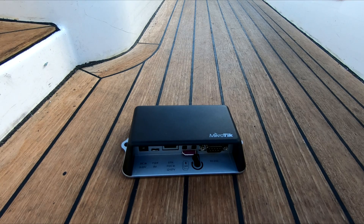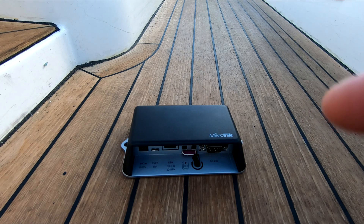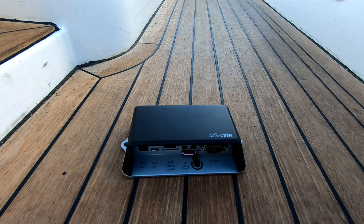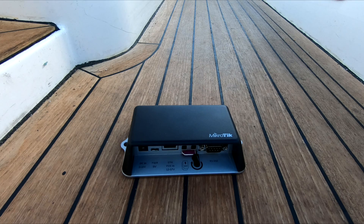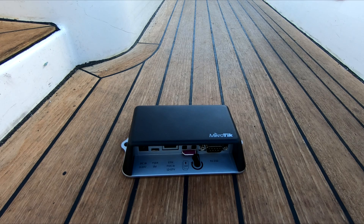The other thing I wanted was traffic shaping, limiting, and control over who has access — because a lot of domestic gear is very basic and someone could wardrive your Wi-Fi hotspot quite easily. This is not quite enterprise grade, but it's SME grade. The Mikrotik router OS is quite powerful and configurable. I've set up certificates, so all devices have to have certificates to join the Wi-Fi network — it's not just any device joining with a password. That proved interesting with the TV, but I worked out a solution.